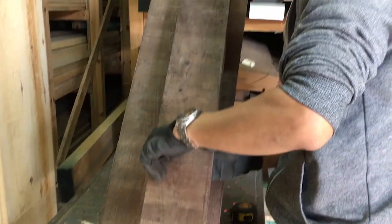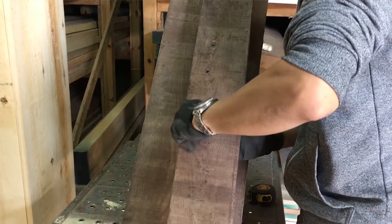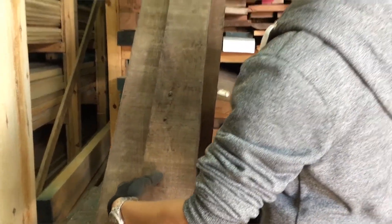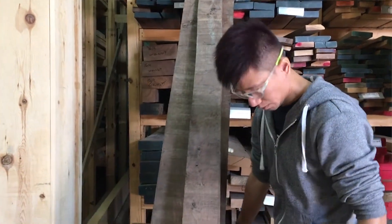The next thing is knots. Knots occur when a tree branch is growing out and the way the board has been cut leaves a cross-section of the branch in the board. They're generally not preferred when selecting lumber because they are considered a weak spot in the wood, and when you dress them they might pop out or damage the machine. If you find a piece with knots in it, don't put it directly into a planer — that section should be cut out before dressing.